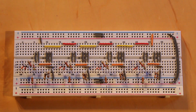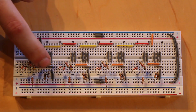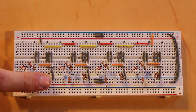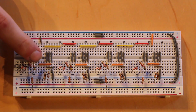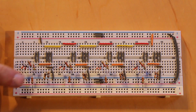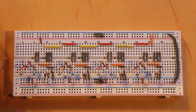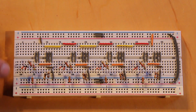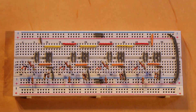To explain what we did: we connected the suppressor grid to the cathode, which goes to ground through a gray jumper. There's a 10kΩ resistor on the plate, a 100 ohm resistor on the screen grid, and a brown jumper takes the plate output to the other side. For the control grid, there's a 4.7kΩ resistor, then a 22kΩ and a 33kΩ resistor — the 33kΩ goes to negative 12, and the 22kΩ goes to two diodes that share one side and split on the other for the two inputs. That's the same for all four tubes.